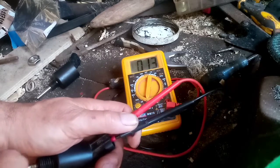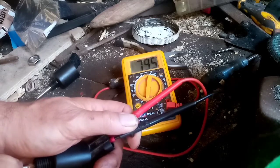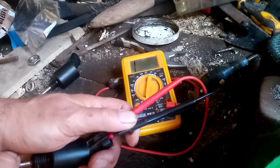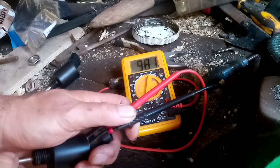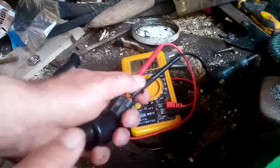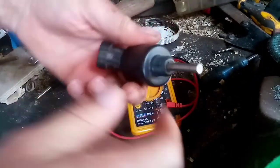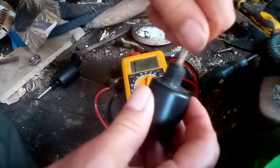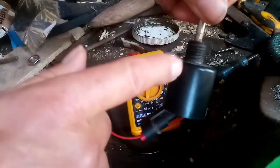It's running nice and smoothly, coming down from a thousand ohms. Gets near the 500 mark and then suddenly it's jumping everywhere, and then it's back around 300-200 working nicely. So it's just in that area where it's been working. I assume what's happened is around that 500 it's set, then it's just moving slightly - maybe a quarter of a turn - in the area that's been working, and it's just worn something out in the potentiometer on both of them.